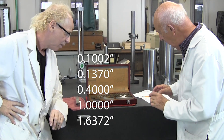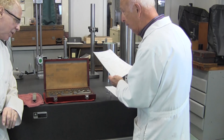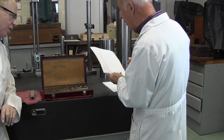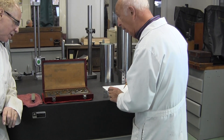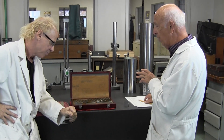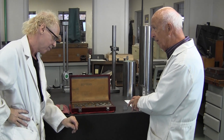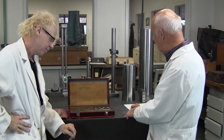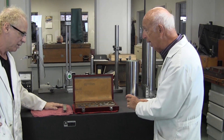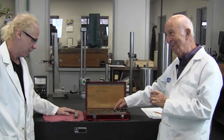There's your stack. Now in the meantime, I've warmed that block up with my hands. So now I'm going to go to the deviation chart if I have to, and I can look up each one of these blocks. I'll look up the one inch, see how far off it is, and look up all the other blocks and add up the deviation. If the deviation adds up to almost a tenth, I write that down as a tenth. By your hands warming it up, it's going to expand - heat expands. So you always have to be very careful about keeping your hands on them too long. This is a static measurement - it does not measure by itself. So you need a height gauge, or a surface gauge, or a micrometer just to double check it. You could make a mistake and pick the wrong block - then you could scrap your part. So you've got to be careful with that.